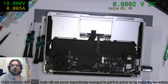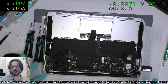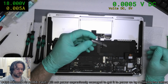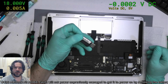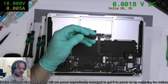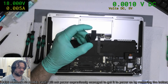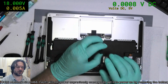Let's see. What software do you use to test MacBook hardware? There's a few different things. What I generally use now is, well, what you've seen here, and that is just an installation of High Sierra. I'll put it onto a USB stick. These are 32 gig sticks. And on that I have things like the keyboard tester, what else? And then you run FaceTime to check the camera. You run the speaker settings. What else was there? There was the Valley test for the loading of the CPU.